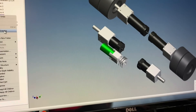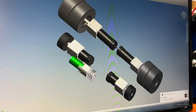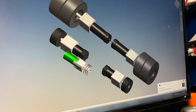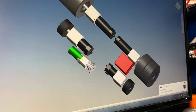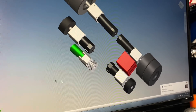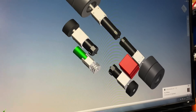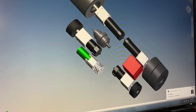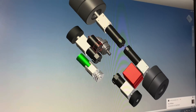We're going to go ahead and slap a 4.5-inch tire on there. I've got my drive set up. This is the motors I am planning. Normally I spend some time orienting stuff — the gap I picked here is based off the size of my batteries. I wanted to leave enough room for foam around them and connectors on the side. Then I tried to see what it would look like if I shoved my servo parts in there — that's the Apex gearbox, which actually gears down the arm. Then I put the motor that's supposed to drive that, plus the motor to spin the blade. Then I want four aluminum pieces going this way.